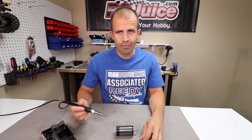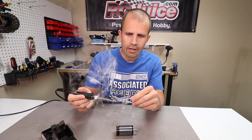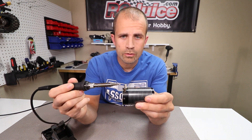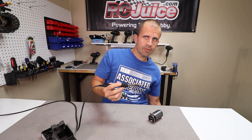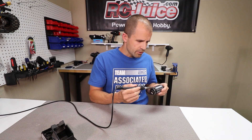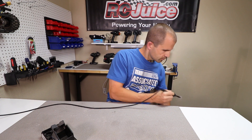So here's a real quick and easy tip: always tin your soldering iron first. Then all we're doing is heating up the one spot of solder we're working on. I apologize — I'm going to do this away from the camera because I need to. All you want to do is get it good and hot, then do it over a garbage can or something.